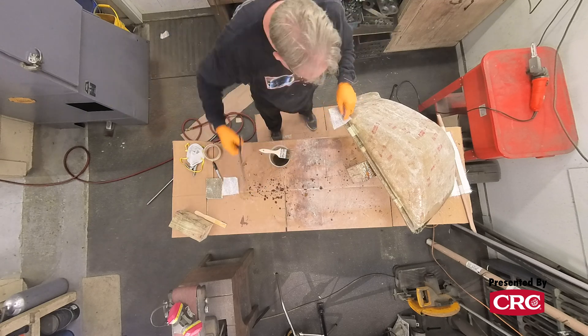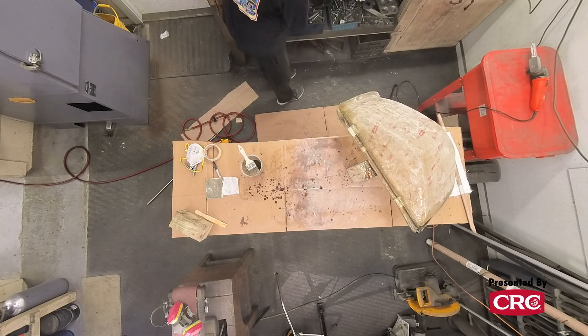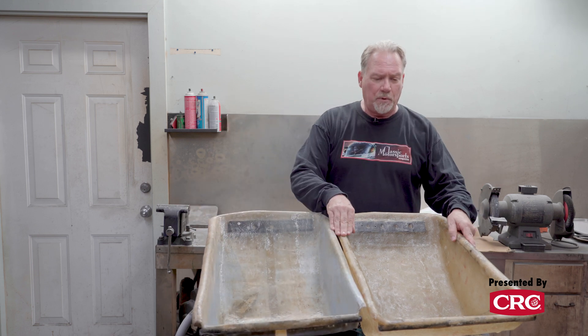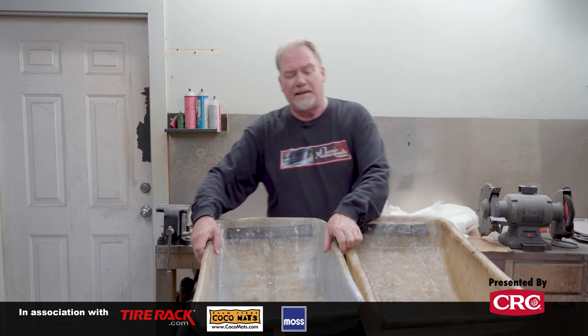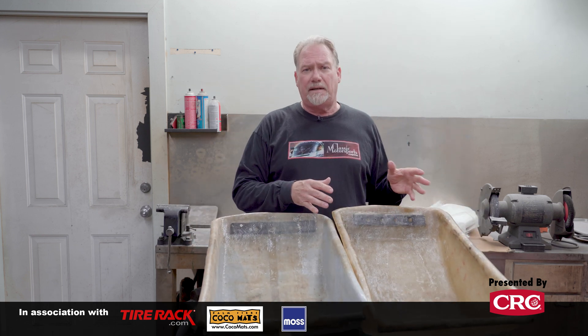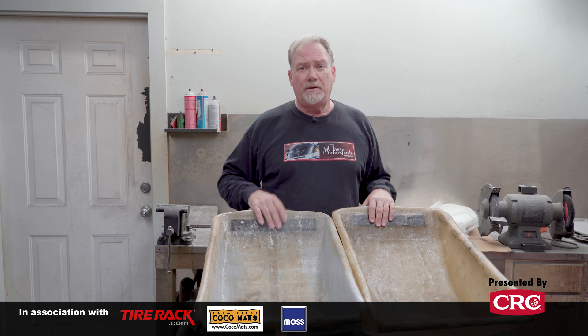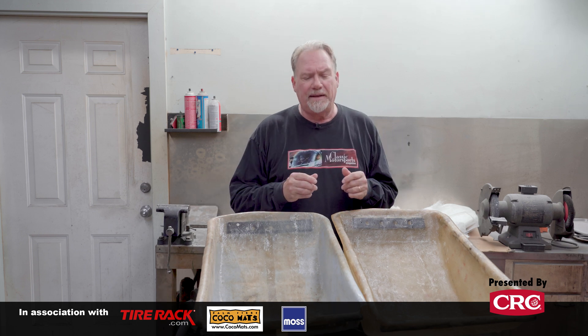This doesn't look like all that yet, but once we get it dry, sand it down, and touch up a couple areas, we've recreated a seat. This is essentially how you'd make any part out of fiberglass. We're done — we now have two seats. This is the original, and this is the one we made. It came out pretty much perfectly. It's strong, it weighs about the same as the original, very little differences. These are going to get covered with fabric. This process is exactly the same if you're making a cover for your outboard, a fairing for your motorcycle, or a quarter panel for your Corvette.